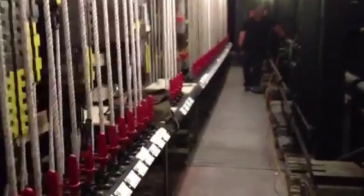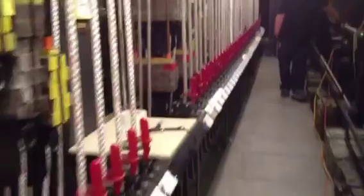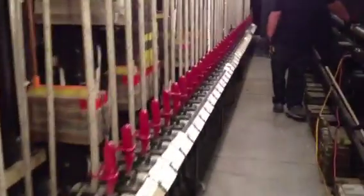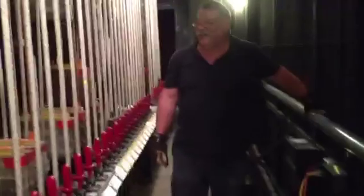This is the Operator's Gallery. I'm talking with Smitty — every load out on these battens is counterweighted with twice the weight over here, because it's a double purchase system. So that's the Operator's Gallery.